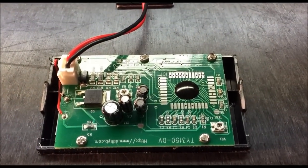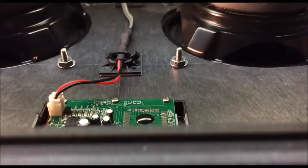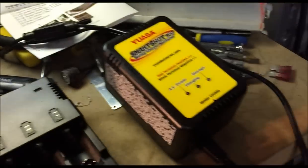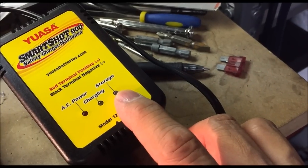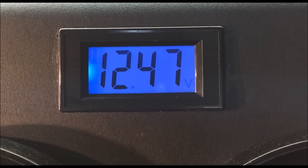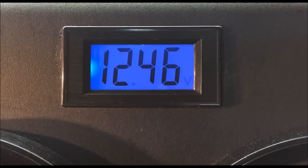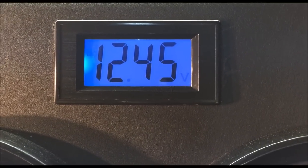This is a two-conductor voltage meter — it just requires red for positive and black for ground. Once you power it up, you'll get a voltage display on the front. For 12 volts, it gives a pretty good indication of battery state of charge. This one's about half charge. The smart charger takes it up to about 13.5 volts; once it gets there, the yellow charging light goes to green storage and it does a pulse charge. When you unplug it, this battery will stay at about 12.9 volts, which is fully charged. When it gets down to about 12 volts I consider it discharged, and once it drops to 9 or 10 volts you can hear the sound quality start to drop off with some distortion.